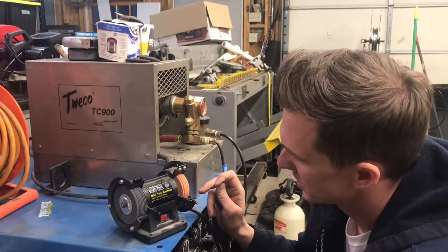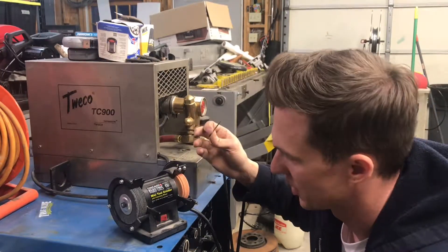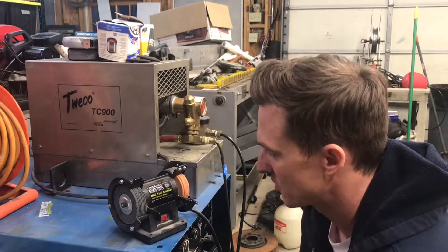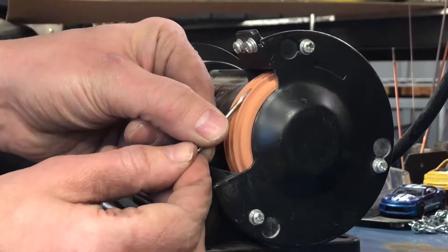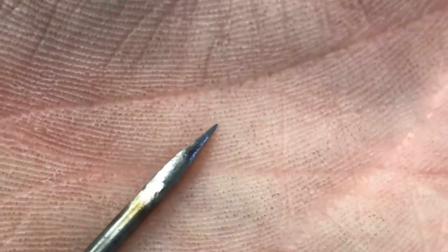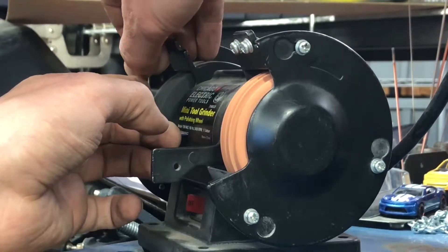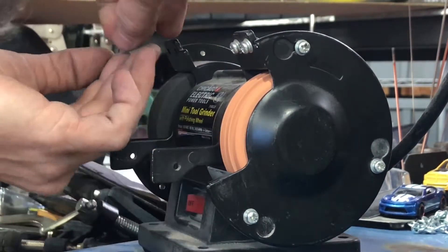Normally they say when you're sharpening a tungsten you grind in the direction the wheel is spinning — it spins downward, so you'd sharpen in a downward motion. I've found a better result by sharpening in the opposite direction. The problem with doing that is the tip can get red hot, break off, and become a projectile. I haven't had that issue because I sharpen from the outer diameter toward the tip, starting a little further back and rocking into the tip just as needed. It gives a nice needle-like point without the tip breaking off.